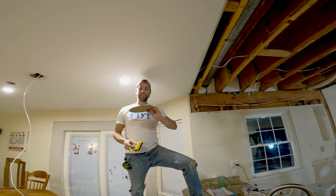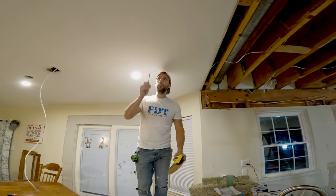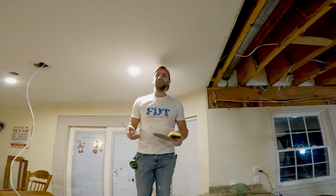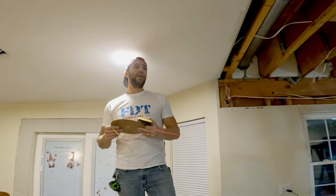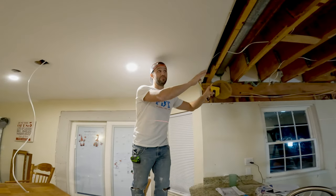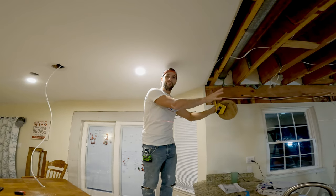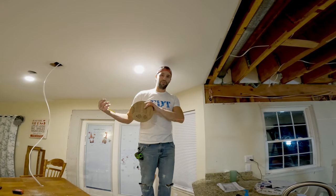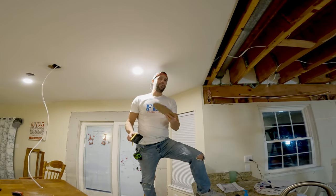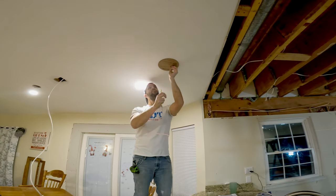Before we decide where to put this, a couple of things we've got to consider. We have to consider plumbing and HVAC. Go above it — try to see if there's any plumbing or HVAC there. There's nothing above here. We did those first because we have plumbing on that side of the house, so we did those first and based these off of those. Always work on your most restrictive area first, then work your way towards the least restrictive area. We're going to go directly in between two studs, line it up right with the laser in the center, and we're going to trace.